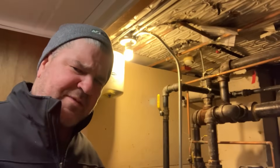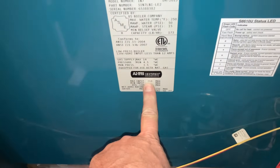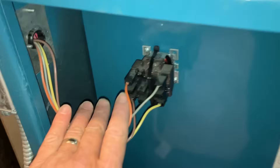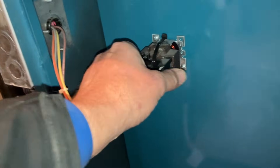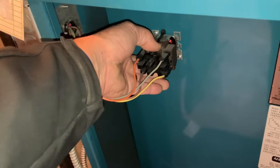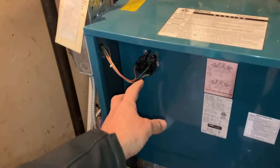I'm thinking that we got a power problem here. We have an SIN7 — this is a 110,000 BTU input gas-fired steam boiler. This is that thermostat relay. We have our low voltage connections going to this relay, and you should put a zip tie on it to keep it secure.